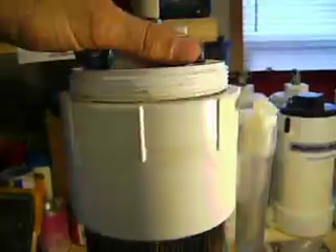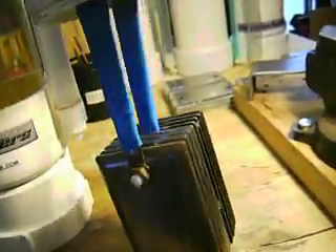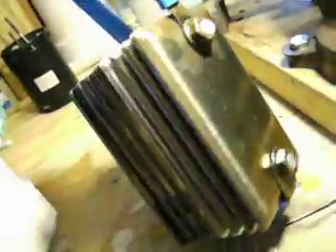So let's take this brand new unit out of here. You can see, if you look at it, there's a little bit of a bronze hue to the stainless steel — that's normal. That's what happens to stainless steel when you start putting current through it. So if you observe that bronze tinting to your cell, it's a good sign, it's a healthy sign. It's the beginning of making that catalytic layer on the plates.